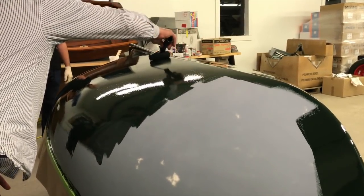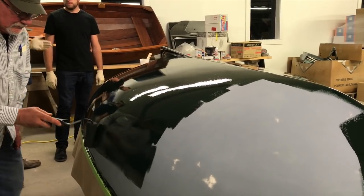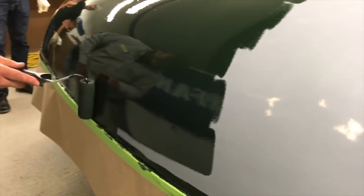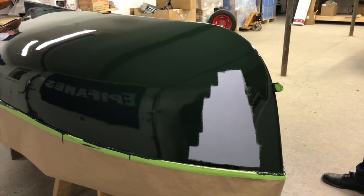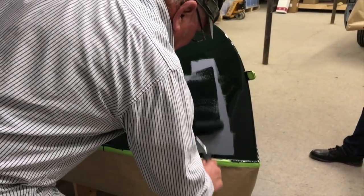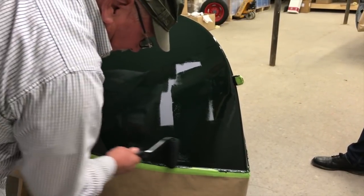After sanding a spot, Jason recommends using a dry rag or denatured alcohol rather than a solvent, as denatured alcohol won't melt the coating. Despite a few roller marks here and there, for a first-time effort the result looks great. Jason tells people not to be intimidated — with this paint system, even a rookie can achieve a beautiful finish.